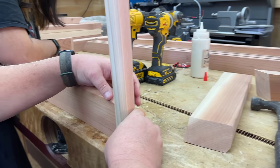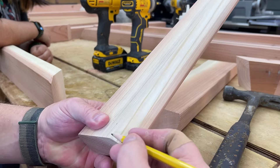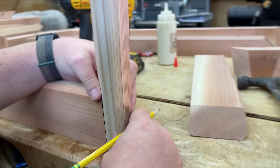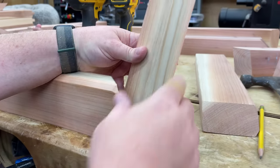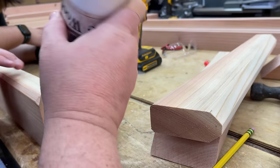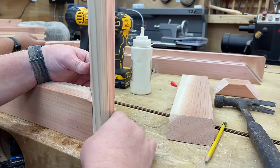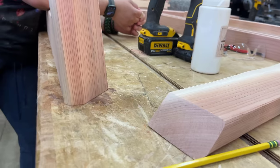I'm going to show you what I think looks the best here. This corner right here — I'm making a pencil mark on this corner edge of the chamfer. I want it to line up perfectly with this edge of the rail, so I'll put it there and slide it back until it comes perfectly with that edge of the rail. That's how I want the rails to contact the legs. Since the legs splay out, we just want to make sure that contact point is at the top of the table. I'm building the table upside down here, so if you mark it like I did, put everything upside down, then it'll be easy to do.